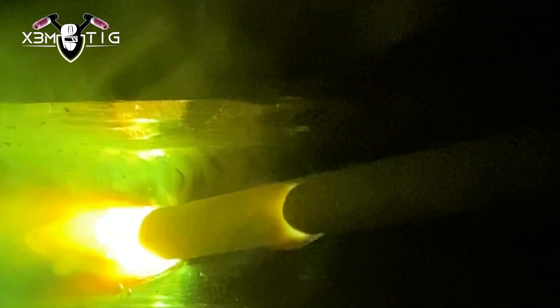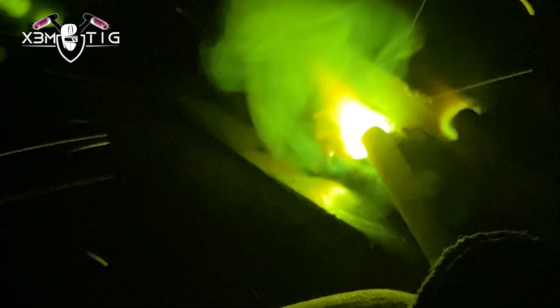Especially for this first pass fill, when you've got lots of room, it's pretty much like flat welding — you want to give that stick a higher angle, let's say 30, 40, 50 degrees. It all depends on the joint configuration, your welding technique, and manipulation. For the second one on the top part, as you can see I manipulated the rod up and down slowly, keeping inclination around 10 degrees. I want to fill it up and create that bead shape to fill it in properly.